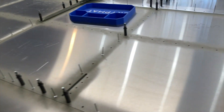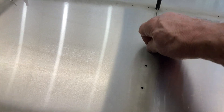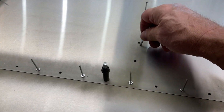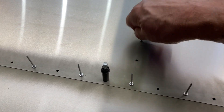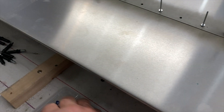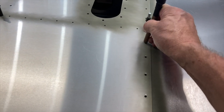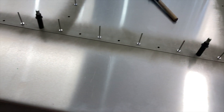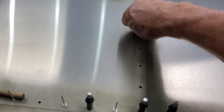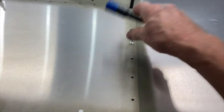I took my own advice and this works a lot better. I know my riveting pattern and they slip right in. If I were to cleco all this up and leave those gaps, they'd fight me a lot more. I can do it with my hand now - I used to always have to use this tool to wiggle them in. Let's see if it'll make a liar out of me... no, that one's in!